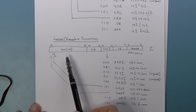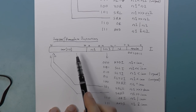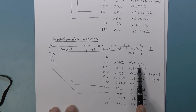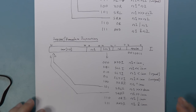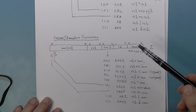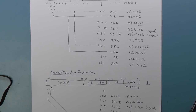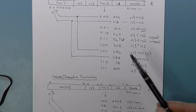With these instructions you can load values into a register. For example, to load an immediate into a destination register, you set RS1 to register 0 — that's adding 0 plus the immediate and putting it in the destination. Again, there's no dedicated move-constant-to-register instruction. We have all of these instructions to implement, and the traditional way is with an ALU — an arithmetic and logical unit. I'm going to talk about shifts separately and focus on add, subtract, less-than, XOR, OR, and AND.